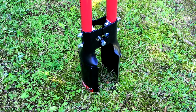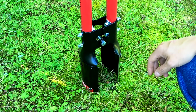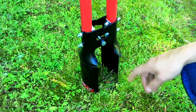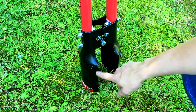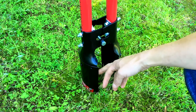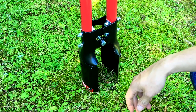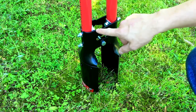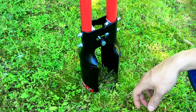Another consideration is the construction of the tool itself. A lot of them are what I would call monolithic stamped steel — the entire structure is one piece of sheet steel that's been stamped at a factory. This one took a different approach, which is what I remember as a kid with the more sturdy units. You've got an upper hinge piece of stamped steel, and then a blade that's riveted on. When I was a kid, the blades were actually a thicker steel than the hinge, and that's why they were riveted on — it was stronger than a weld and gave a denser cutting blade. These ones feel like they're the exact same gauge, so I'm not sure why they took that approach, but it seems to be durable. They've reinforced the bolts for the handles with a curved washer on the backside so it doesn't crush the fiberglass. And best of all, this unit is made in America.